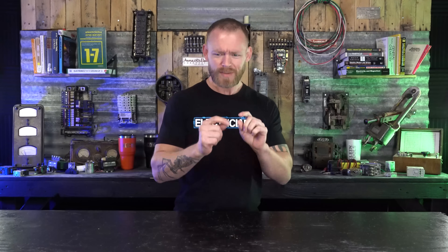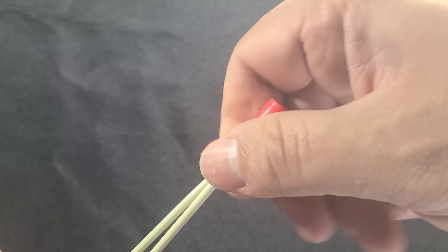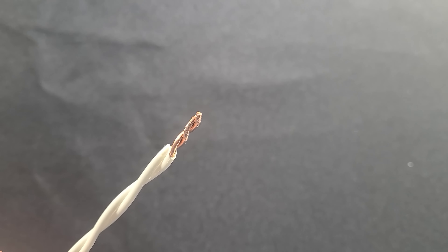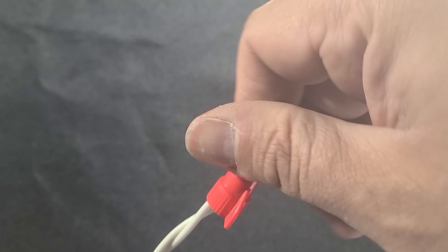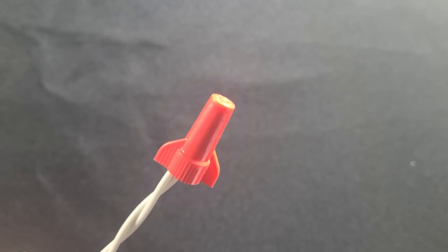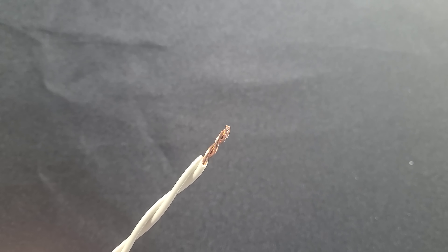There's a debate about whether or not you need to be twisting things together in a wire nut — to me that's a more solid argument. If you don't pre-twist your wire nuts you don't have a solid connection; you go to untwist the wire nut and everything just falls apart. I'm of the school of thought that I always pre-twist all of my joints. Nothing says you have to, but I always want solid joints — I want that joint to stay and the continuity of the circuit to still exist even if the wire nut comes off.